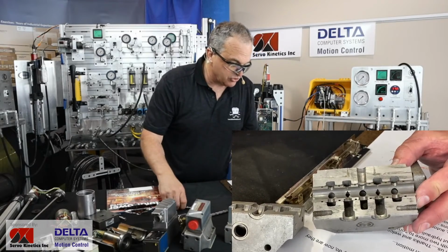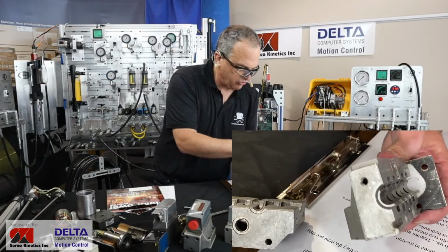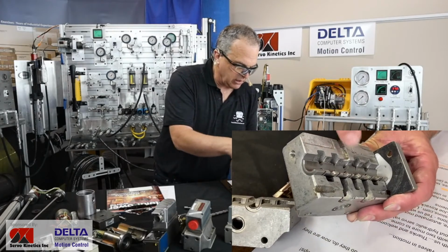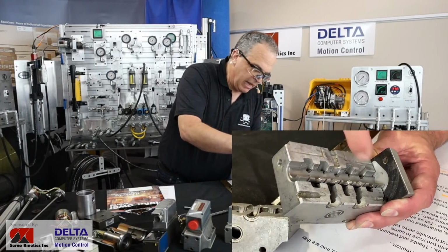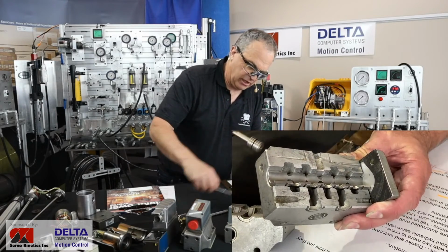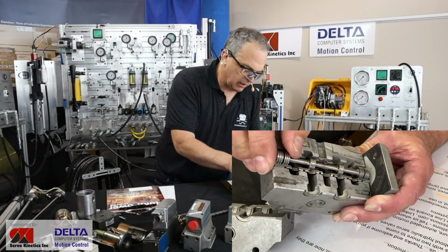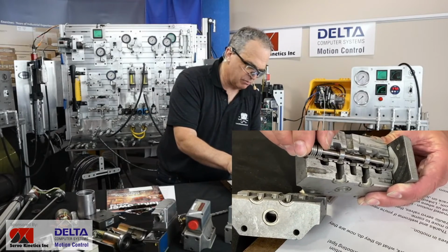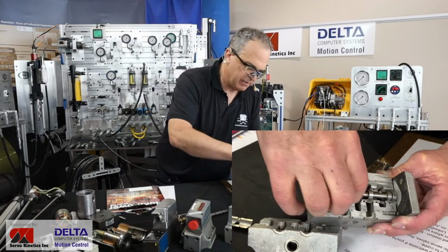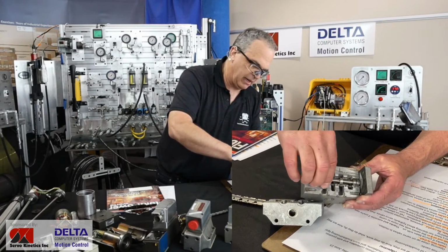And so that spool sleeve was trapped in there on both ends with the pilot caps. You could see some gasketing there that controls where the pilot passages are and how that gets to push on each end of the spool. Do I have the right spool? Yes, I do. So that sat in there like that, and pilot pressure would build under one end or the other to move that spool back and forth. And there's that little hole in the spool there for the feedback wire.